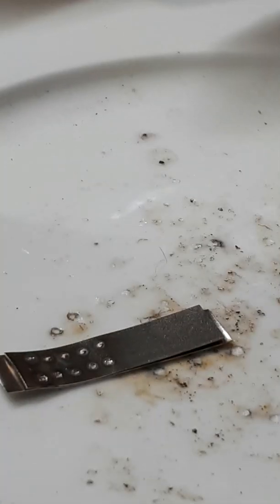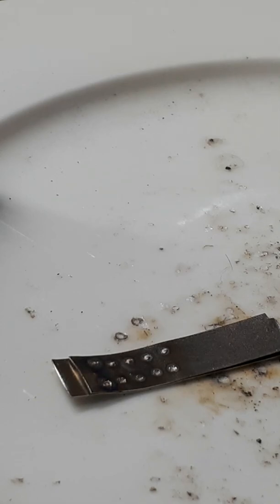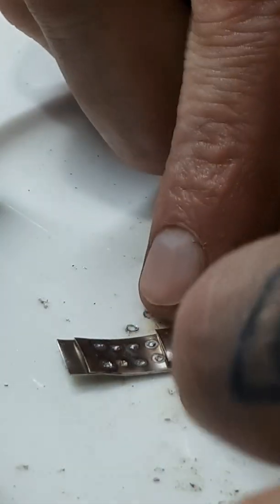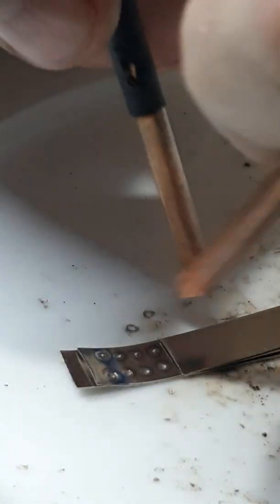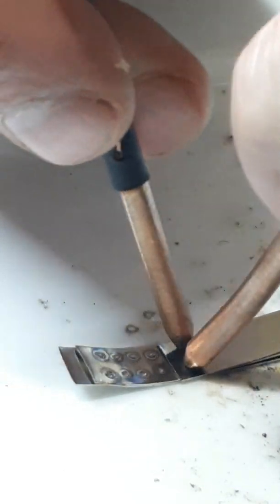Now I'm on a different timing and this will be three layers of 0.2 nickel. It can weld two to three layers that aren't welded together on top of a cell and weld them to the cell with the full timing. This is an 800 cold-cranking amps battery.